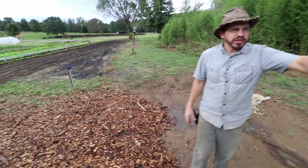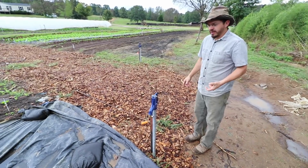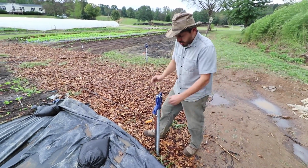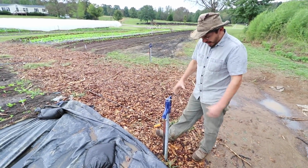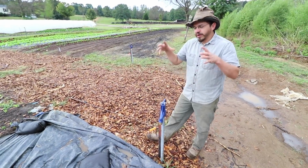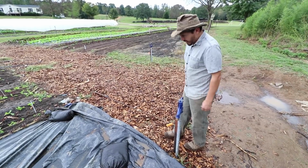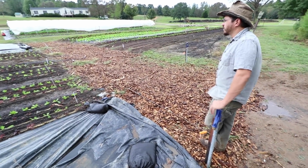And so since it's running from that well to 1.5 inch main line, and then we run 3/4 inch line to our hydrants, which has a T-post that's drove down. And then at this hole, we filled it with pea gravel so that the water can drain. Yeah. That's really important. Yeah. So every field's got this, and so that's really important.